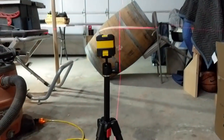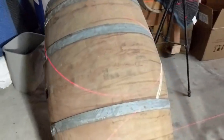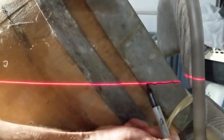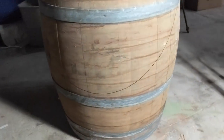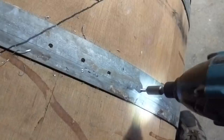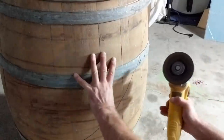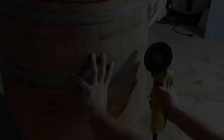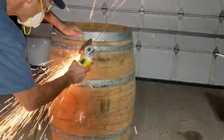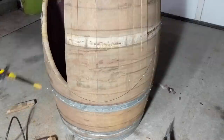The first challenge was to make exact markings on the barrel where to make a cut. For that purpose we used two self-leveling lasers against each other — the best tool for this task. Before cutting the boards, we secured them with screws, using stainless steel screws to screw each board to the metal hook. We cut the metal hooks first, then using a sawzall we followed our marked lines and made the exact cut.